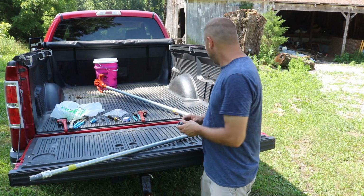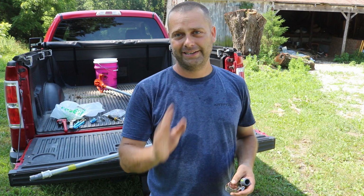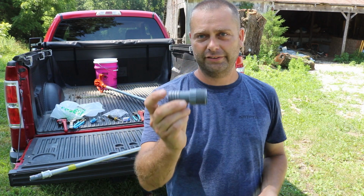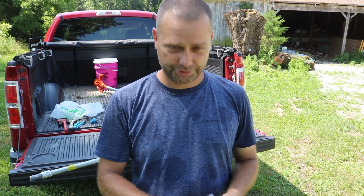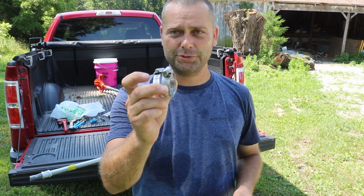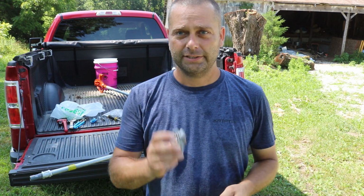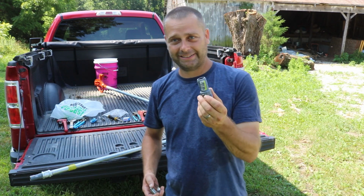So now we're going to go ahead. I need to actually get in the pit, and I need to hook up a barb fitting inside the pit on the water valve. So I've got a barb fitting here. And the way you hook that black plastic pipe up is you just use these, basically hose clamps. So we use two hose clamps over the barb and tighten it down over that black rolled piping. And that's all there is to connecting that water line.